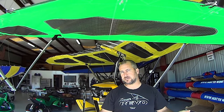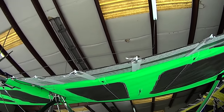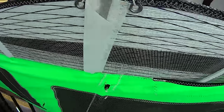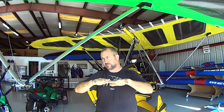Near the root of the wing it's sewn all the way across the center. We didn't want the wing to billow in the center — we wanted it to stay in what we call a low twist for maximum lift and efficiency. We don't need the center to billow shift for the wing to roll; we need the outboard section to do that. We rely on the inboard section for lift, so we kept that efficient and put really large billows — perhaps larger than any other double surface wing on the market — out toward the wingtips.